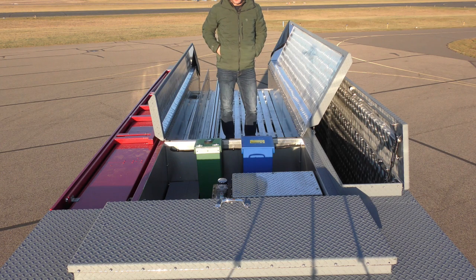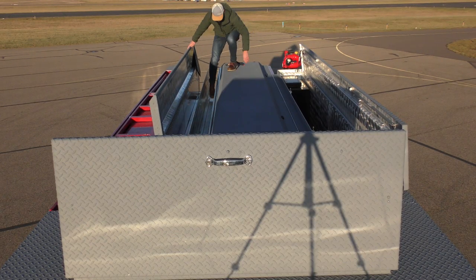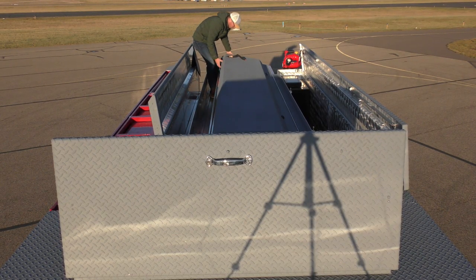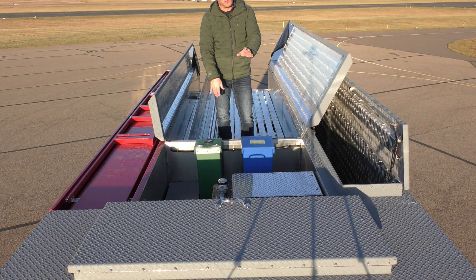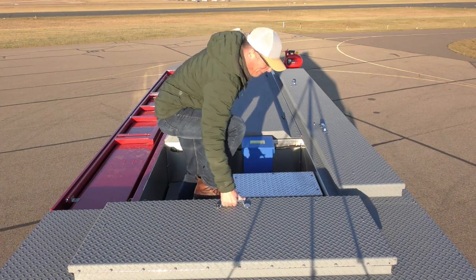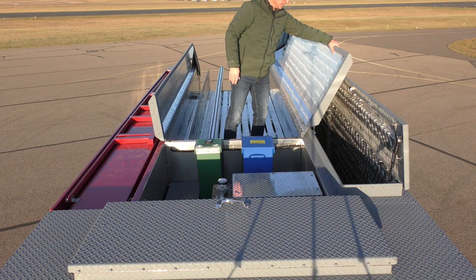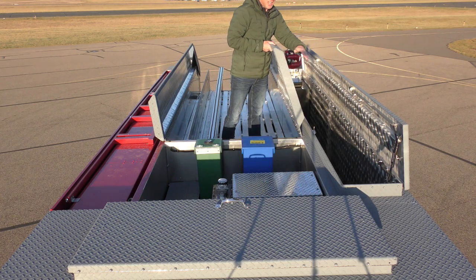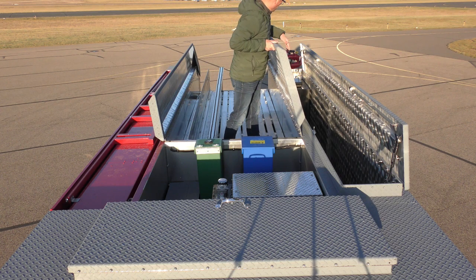Okay, so I'm standing up at the top of the truck obviously, and I'm within the hose bed here. We have 2 hinged hose bed covers. You can see the ladder rack is nested up here. And then we have the foam and the water fill stacks for the booster tank. Hydraulic generator resides at the front of the tank in this dunnage area. The lid here covers the 4 Cascade bottles. And then on the driver's side of the body we have a long, deep coffin compartment.